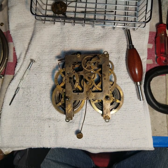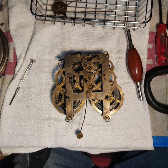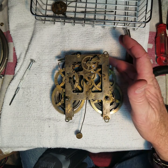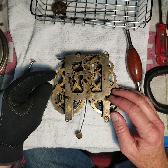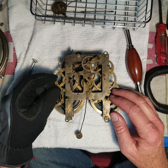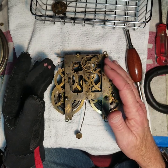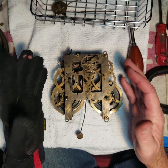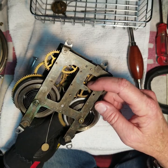One of the things to do — and in the old days they would do a drawing of where all the parts were, because there's a time side and a chime side. Over here these gears run the time, and everything down on the other side is the chime — the strike wheel tells the number of hours. I also take pictures. Since I now have a video I can zoom in on it. The tricky part is these wires and where they attach, what they go under, what they go over. We want to mark them and take a picture.